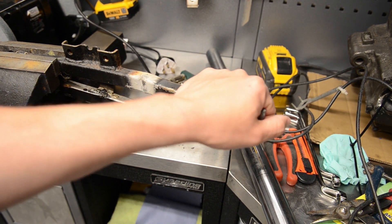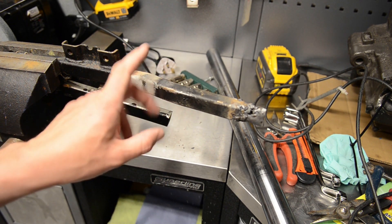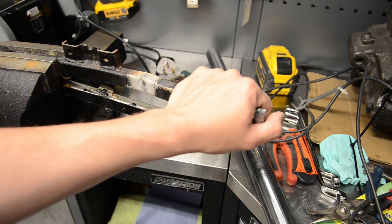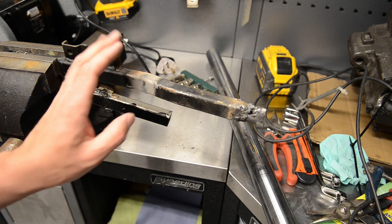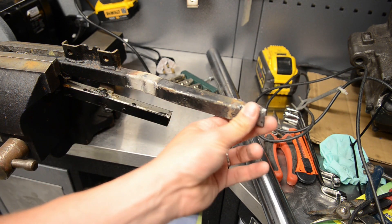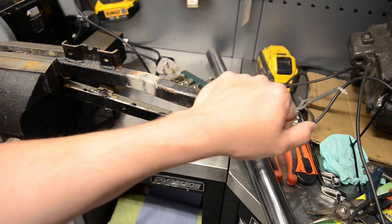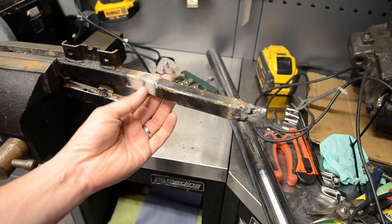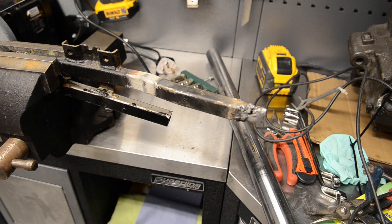This was one of my tests - I bent this pipe and as you can see there's a good kink there. I didn't fill this pipe with anything, just to see whether propane would actually heat it enough to bend. Ideally you'd use acetylene, which gives much better heat, but I don't have acetylene here so I have to use propane. I also did some test welds - burnt a few holes just making sure my plant was set up right. Stick is not ideal for this job but that's all I have.